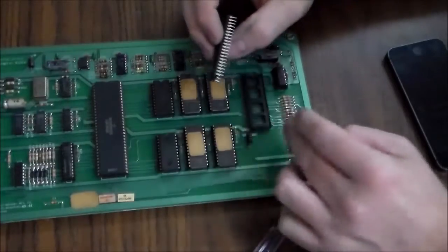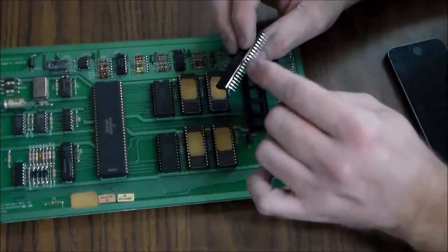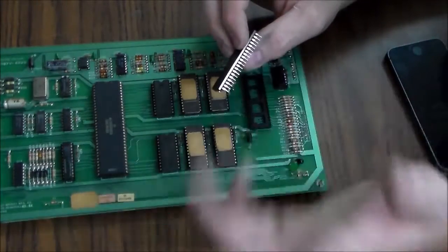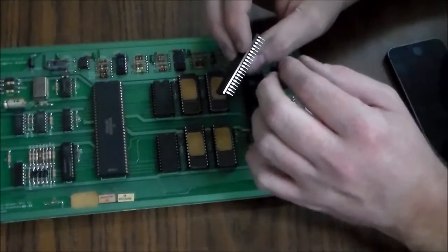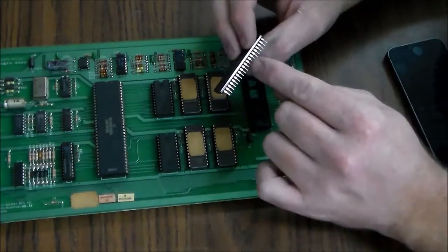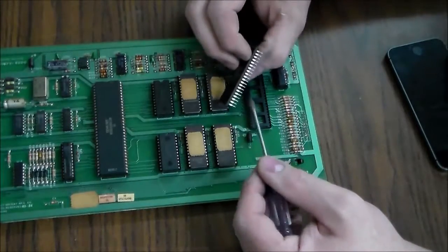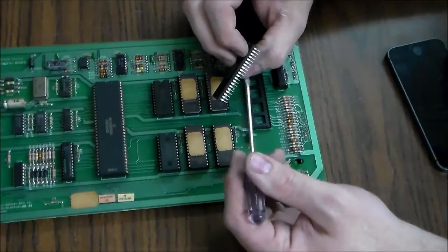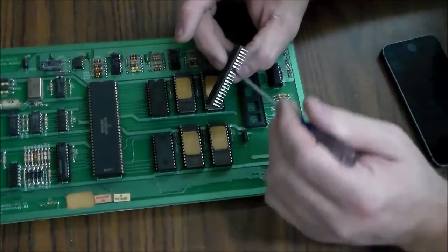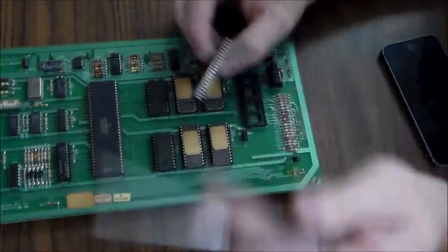So the way it works, the board sends signals. It's talking digitally to everything. So on this one pin, it may be sending a pulse, whatever the clock frequency is, I think is how it works. I wouldn't even want to guess how many times a second it sends a pulse, but just for sake of argument, let's say 10 times a second. I think it's much, much faster than that, but we'll say 10 times a second. So it's sending little pieces of data 10 times a second to this little pin. And if that pin is dirty, maybe 9 of them go through, but for one of them there was enough resistance that it missed that one. And so because of that, if it's telling it to draw the car right here on the screen and then it misses one of them, it might draw a tree right there on the screen or something like that, you know what I mean?